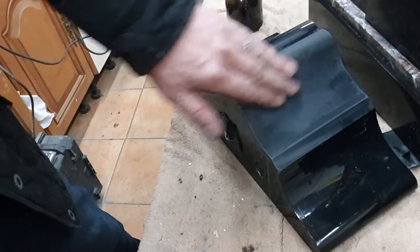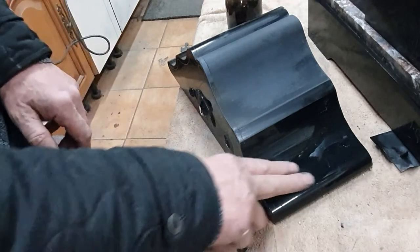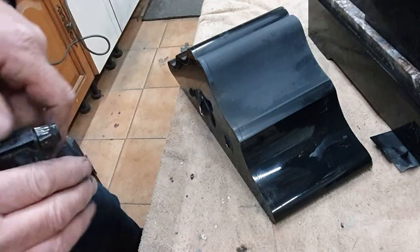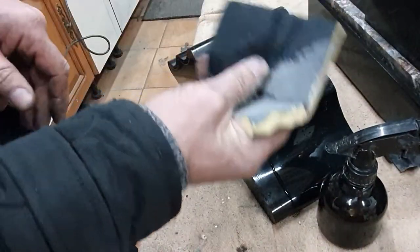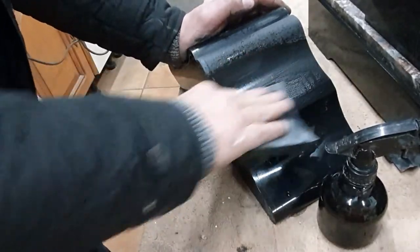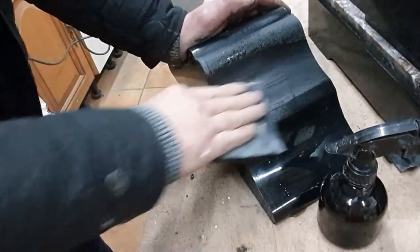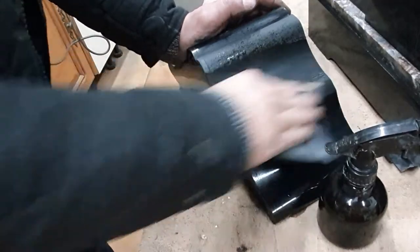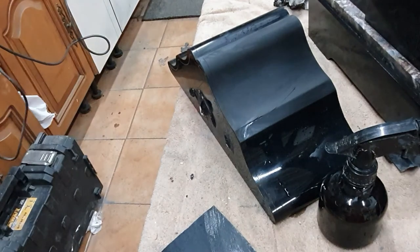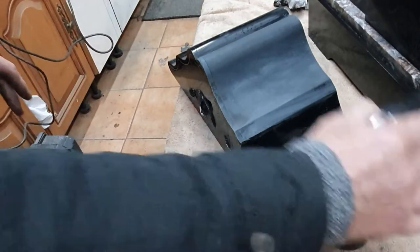Here's the top of it — you can see I've started stripping off the old finish. On the camera this looks really good, but believe me it does look like a plastic finish, which is not what I want for a marble clock. All I'm doing right now is using one of these sponge pads, a medium grit, rubbing it all off. It comes off pretty easily and gets it right back to the slate itself, leaving a dull finish to begin with. I use a heat gun and that'll show me where I've missed.